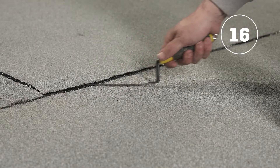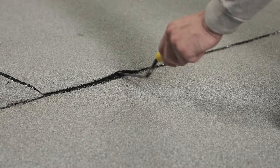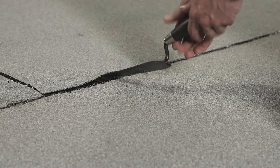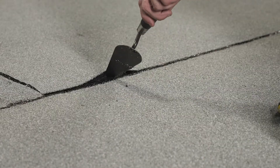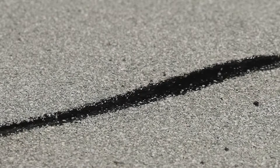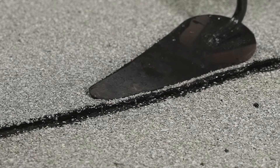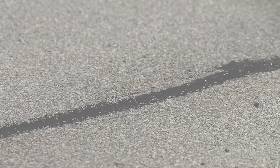Make sure there is a bleed out of bitumen at the end of the roll. If there is no bitumen bleed out, inspect the weld for leaks. If the trowel can poke through the joint, lift that section and heat the bitumen with the torch. Put the membrane back in place using the back of the trowel to create the required bleed out. This installation is now complete.